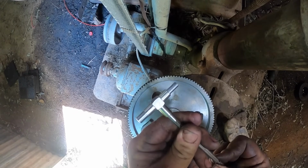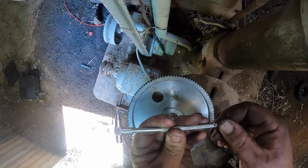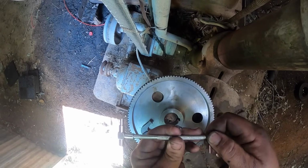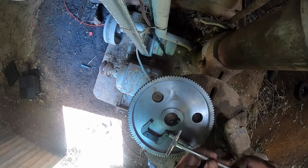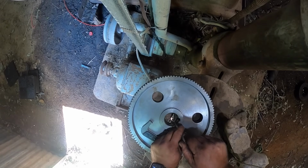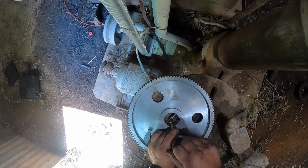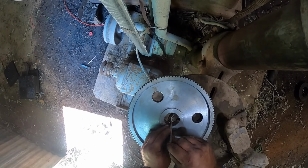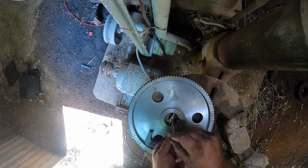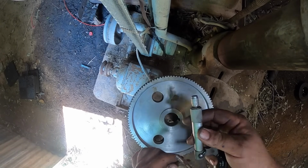This is a bore gauge. So this is a little spring-loaded doohickey, and it's got, I'm not sure what you would call this, like a clamp or a stop here. When you screw this down, it locks this in. And so how you use this is we'll go down in here and release it at an angle. Can you see the angle? Snug it up slightly, and then we will, this is clean in here, I'll wipe this out with a rag, and then we will straighten this up and cam it over and tighten it down.